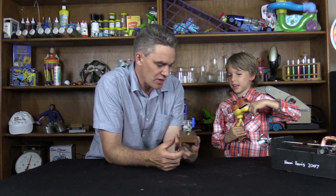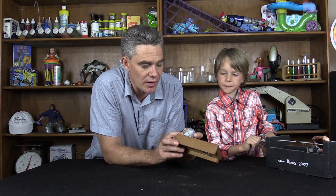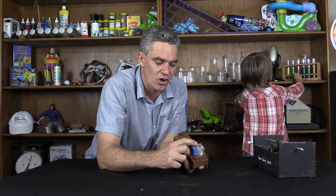This is one that I did myself. I took this gear thing from a commercial product, I think called Gigo. It's got a simple circuit with two LEDs in parallel with a switch in series. Here's a little electric motor. The beautiful thing about a direct current motor is that when you put electricity in, it turns — but if you turn it manually, it actually makes electricity. If you turn it one way, the current goes in one direction; turn it the other way, the current goes in the opposite direction. When I turn the lights off and give it a spin, notice how long it keeps turning — the energy is just changed into friction and sound. But when it's on and I give it the same push, notice how quickly it slows down — that's because the kinetic energy is now being changed into electrical energy.